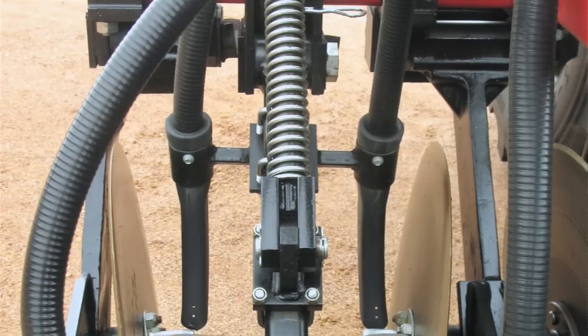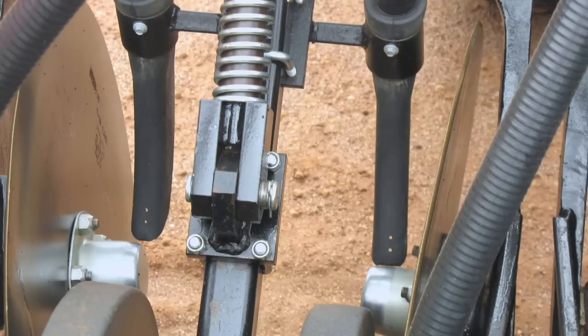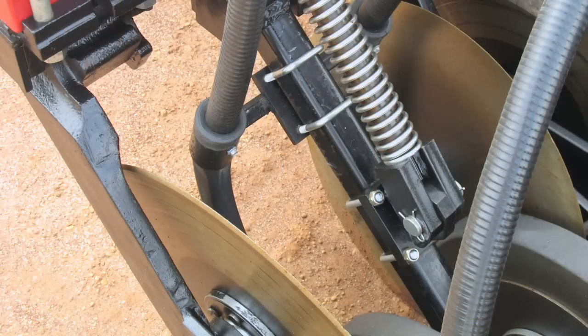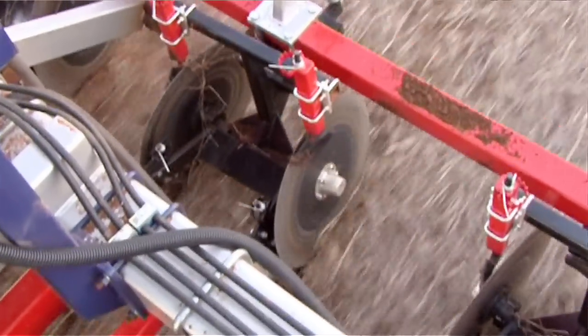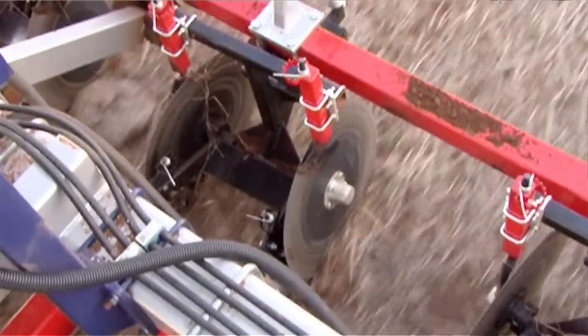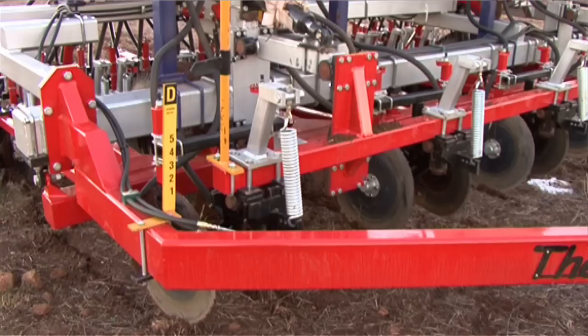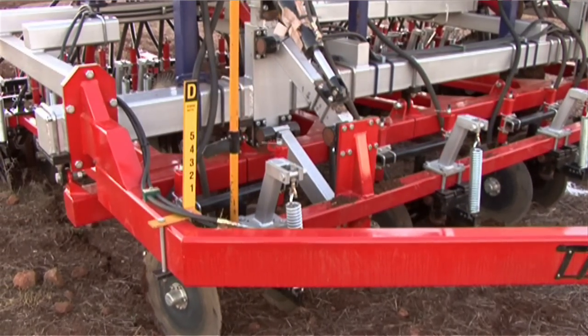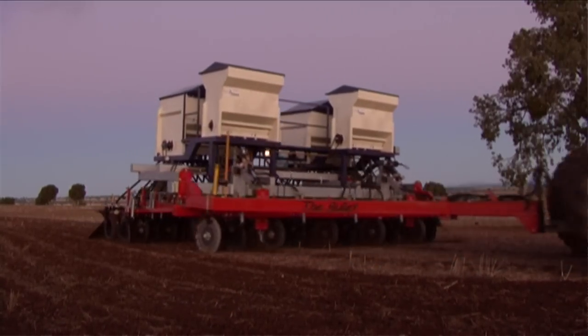There are two ways of applying nitrogen. The first and simplest is a tube where the nitrogen is applied in the form of urea between the discs — useful basically in sandy conditions, sprayed between the discs and incorporated in the moving soil. The other method, much more expensive and complicated, is to fit nitrogen applicators to the front — basically another row of planting discs. The depth is independently adjustable from the seed rows. These can also be used in-row to obtain deep cultivation to combat plant diseases such as rhizoctonia.